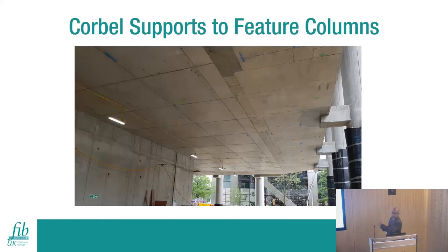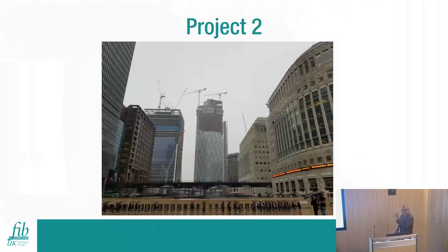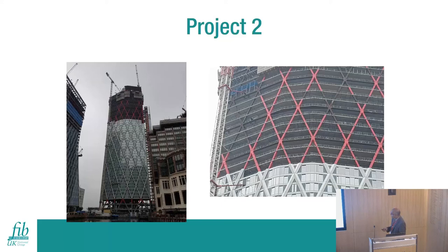On this particular job, the first three levels feature exposed concrete columns - the client wanted to see the circular concrete columns at the front over a total height of five levels, without seeing the slab. The design uses a corbel connection, which is interesting because this is a post-tensioned slab connecting to the precast column using half-joint details properly executed. The second project is the tower you might see coming out of Canary Wharf station - a 58-story tower that Diago touched on earlier, with a mega frame outside and internal floors.